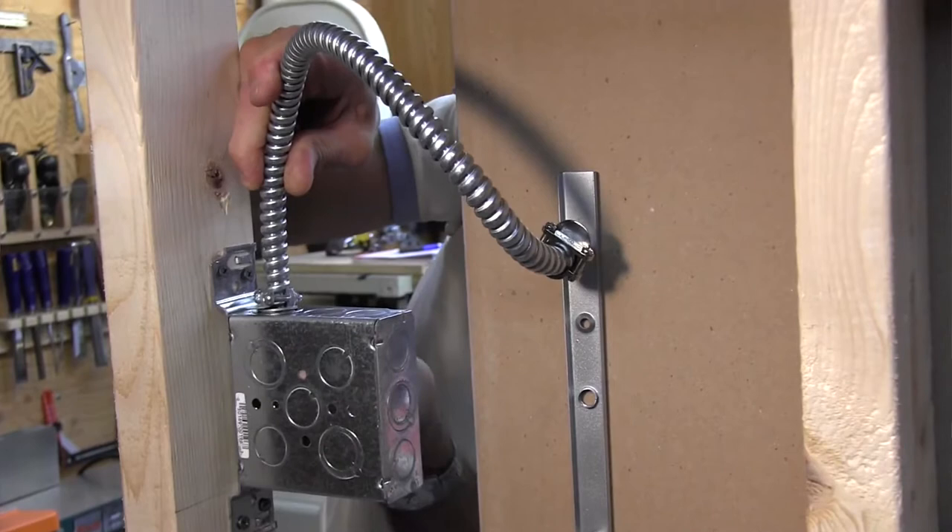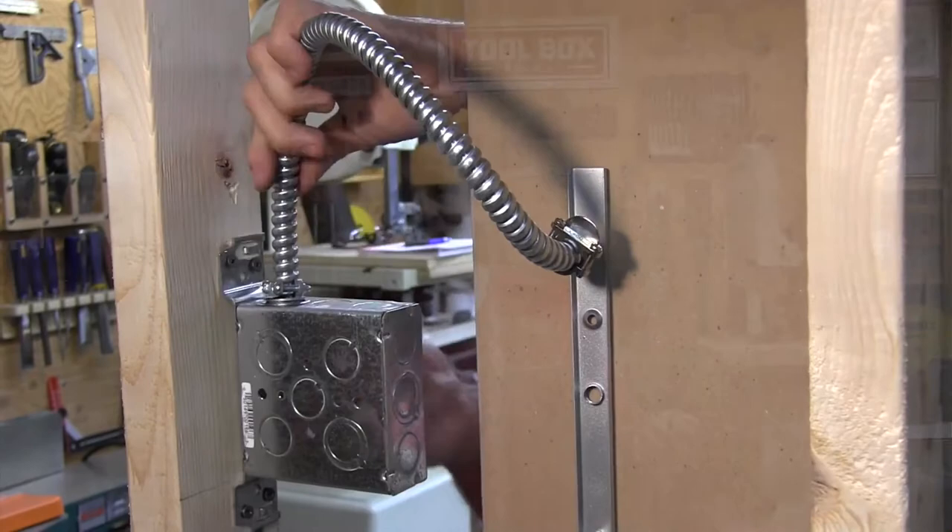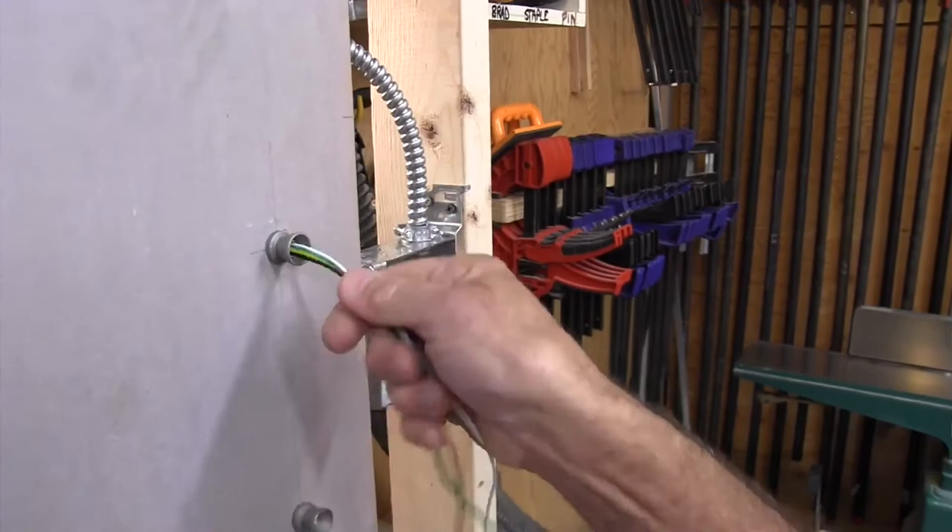Once we did that, we were ready to go. Our cabling was intact and it was time to wire. You take the towel warmer, slide the wires through the wall anchor mushroom, and fish it through the flexible cable until it comes out of the J-Box.